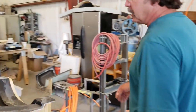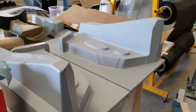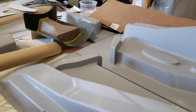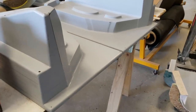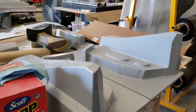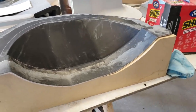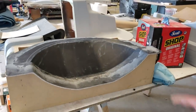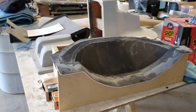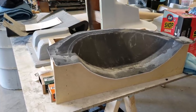Over here, a smaller block of MDF — which is a processed wood material — was laminated together and then put under the machine. These are the machine molds. In this case it's what we refer to as a male mold. You mold over the outside of it, and this creates the side console panels in the left side of the cockpit seat assembly. This is fiberglass, similar to what would be employed in the airframe of the Talon model, which is the most affordable version of the kit. The upper two products, Striker and Voodoo, are all carbon fiber airframe.